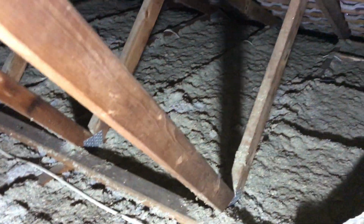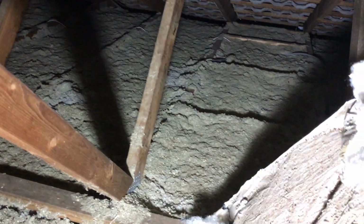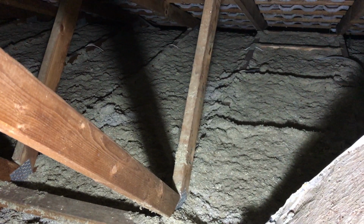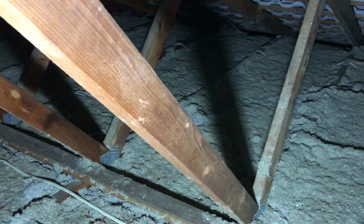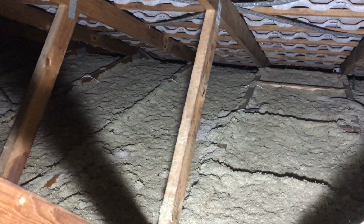Okay, Peter here from Comfort Zone Insulation, just doing a roof inspection for somebody that had cellulose put in the roof. They rang me up because the bats that were put in the extension made a bigger difference than this end of the house, and so they said, oh look, we want the cellulose pulled out because it obviously doesn't work anywhere near as well as bats. And so of course the reason why it doesn't work is because it's just not pumped in properly.